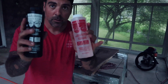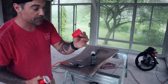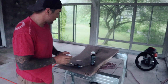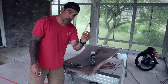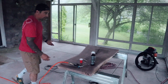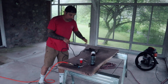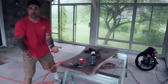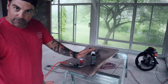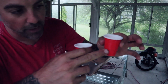Time for epoxy. We've got our two-part epoxy solution — this is a one-to-one ratio so you're mixing them exactly equal. I've got a bunch of these mini solo cups. You can use the lines to make sure everything matches up. I need just a small amount to fill these cracks. Mix it 50/50, start stirring it up, get it in the crack. The other tool I have is a heat gun — after the epoxy's down you run the heat over the top so all the bubbles rise to the surface and pop, so as the epoxy dries there are no trapped air bubbles. Trust me, I've already made that mistake.